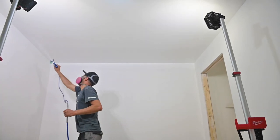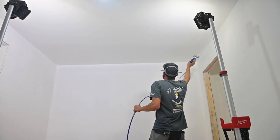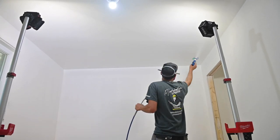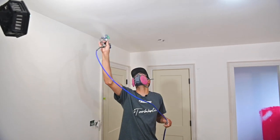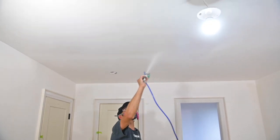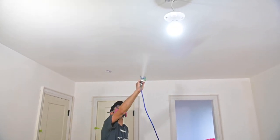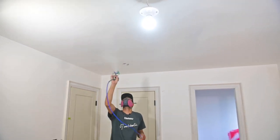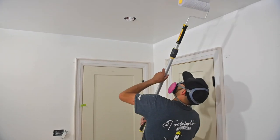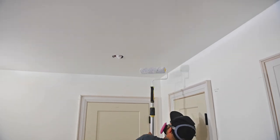Just to run through some specs: this is the only cordless high-performance paint sprayer on the market right now. It shoots 3,300 PSI on a 0.021-inch tip. It's powered by a DC brushless motor which provides extended run times. It does come with a contractor gun and uses RACX low-pressure switch tips. Graco has the weight listed on their website as 31 pounds.